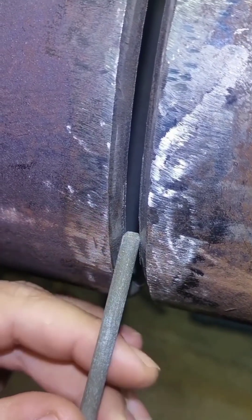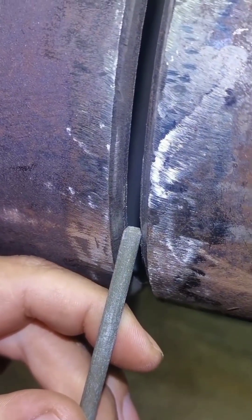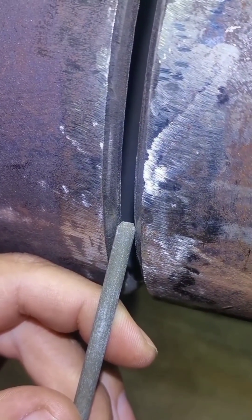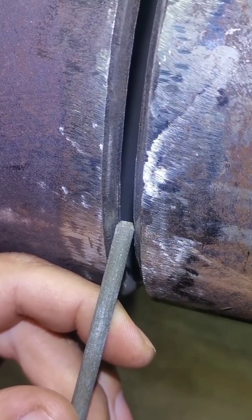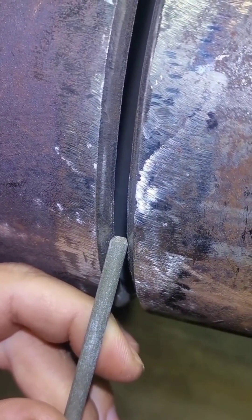Two thirds press the keyhole. Slight shake to turn off the arc. Be sure to watch and maintain the keyhole — the keyhole is the position of the root. Each pass can maintain the keyhole at 0.5 to 1 millimeter. The larger the keyhole, the higher the back.